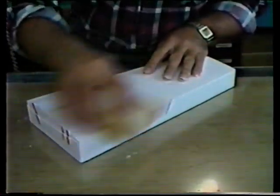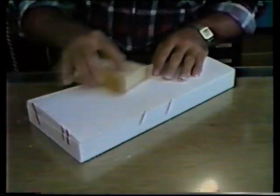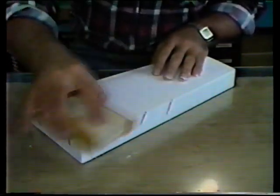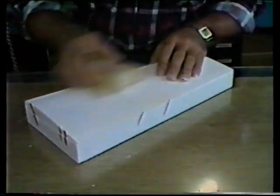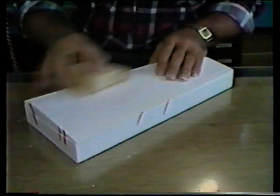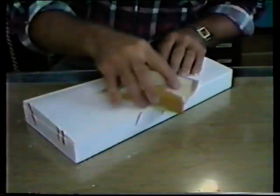But get a nice finish. You can see about how much I'm sanding these cores. Get a nice finish on it. Then what I do is I take a vacuum cleaner and vacuum them. After they're vacuumed, I take it over to my air hose, set the compressor to about 100 pounds, and blow them out. Actually, blow into the little pockets of foam.